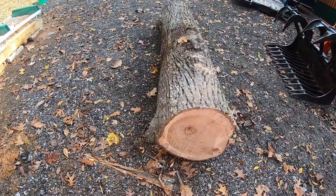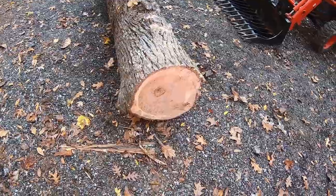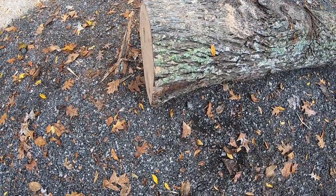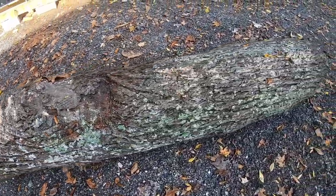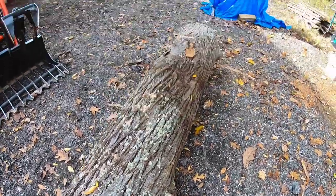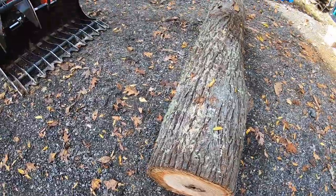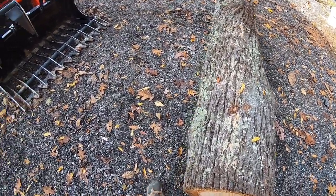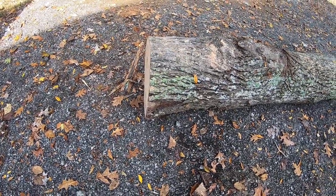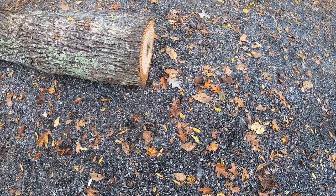Okay, so thought I'd show kind of my decision making process on putting these logs on the mill when they have these blurbs. So this is the top of the cant or log, I guess at this point. And I've checked it for metal. Anyway, it has kind of a wide spot there where probably a big limb came off maybe. So this end is pretty round and straight, except for those two limb defects that came out, and then there's one on top. So what I want to do is put these two on top first to slice them off. The other thing is normally I put the small end, the top, against the saw head. But today I'm going to spin this around because I don't want this blurb there to throw this cant off at too big an angle and end up losing a bunch of it at the other end. So even though that's the top on this particular piece of tree, the smaller, straighter end is this end. So I'm going to start cutting from it.